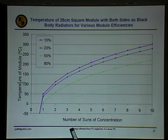You can make more optimistic or realistic assumptions. In terms of the photovoltaics, you're going to be bound probably by the Shockley-Queisser limit, which I think is about 80% even under perfect conditions with an infinite number of band gaps. But again, even if you make that very optimistic assumption and you say your devices are happy at 100 degrees C, you're unlikely to get into the 10 sun range. It's much more realistic to be in the 1, 2, or 3 sun range.